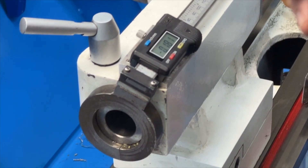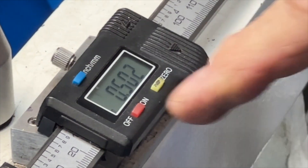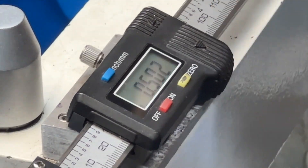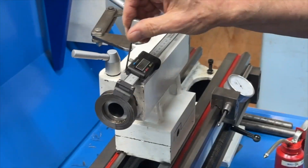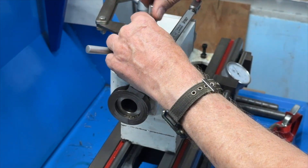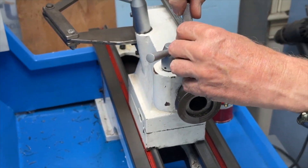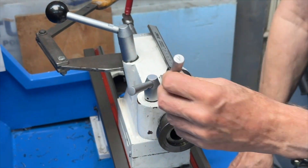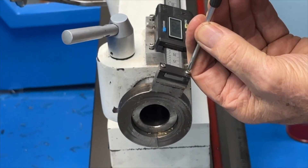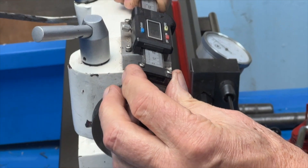This is a six-inch digital readout and it has the horizontal screen. There are other ones where you mount them vertically, but this one is for mounting horizontally. I'll take this off and show you all the parts. To loosen up these screws — this one here has a tiny shim in it to make it level.